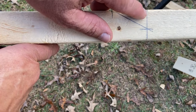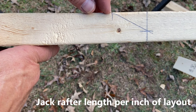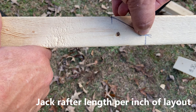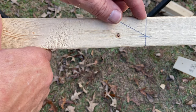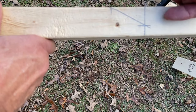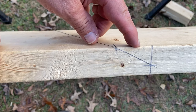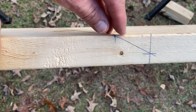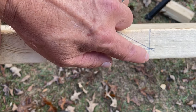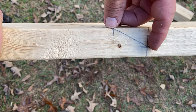In order to make this easier, we'll go up one inch along here, and Rooframers Bible gives us a rafter length per inch of layout. That gives us how much we need to add from the short point for one inch of layout. We're going to move that up and then cut this off square — still on a plumb cut, but square on the end — so we can flip our saw around on the end of it and cut this angle. From our short point for the jack rafter, we are going to go up one and 13 sixteenths. That is the length along the top of the jack rafter for one inch of the thickness of the jack rafter. Then we're going to cut on this angle — a 34-degree saw setting but 56 degrees along the jack rafter. That's a manageable cut for our skill saw.